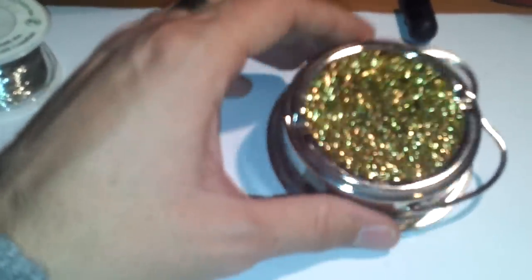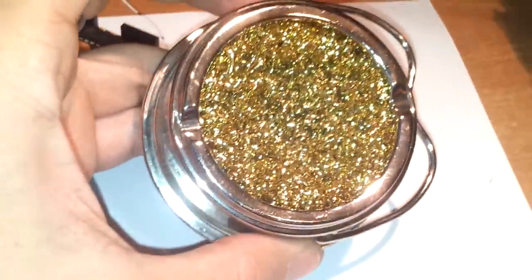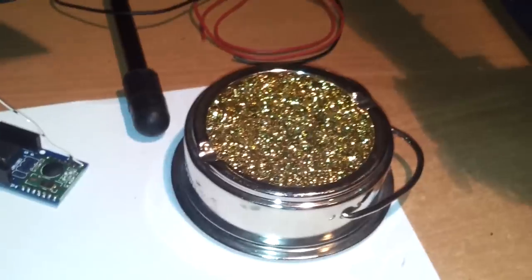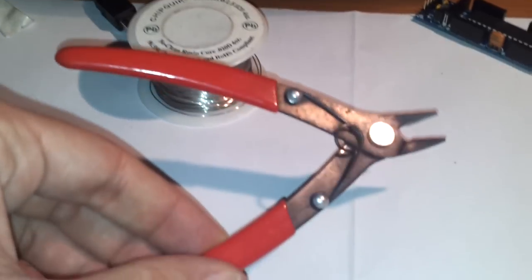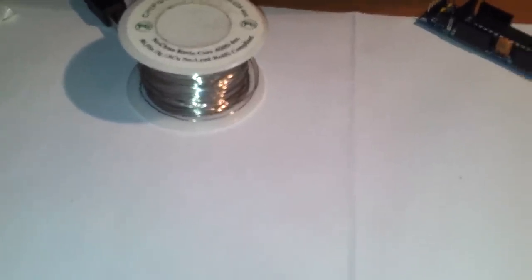You will also need some kind of metal cleaning for the soldering iron. You can also use the regular sponge and water system, but it's better to use metal cleaning like this one, because it doesn't heat stress the soldering iron. We will also use a couple of cutters like this one. So that's it, we don't really need anything too complex to assemble the JeeNode.